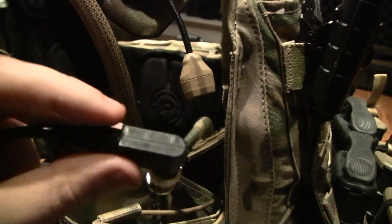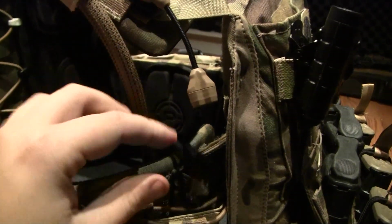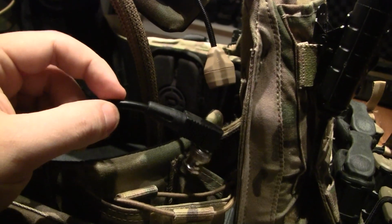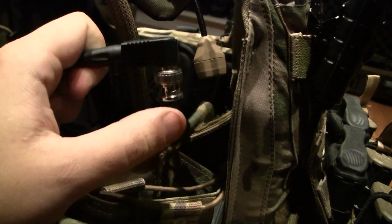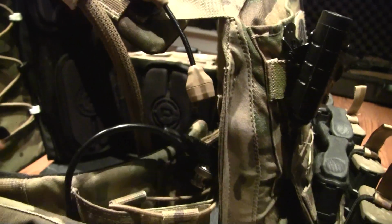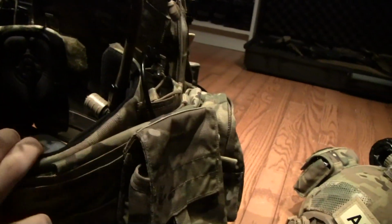All this is a little wing adapter. You can probably see the crease there. That simply spreads open, and you work inside there. Strip back your insulation on your signal wire and connect the signal wire into the center core of this little connector. Simply screw a screw down and you're good to go. You close the wings back up and you're good to go. Now all this does, let me zoom out and show you here. Like I said, it's pretty much an extension cord.